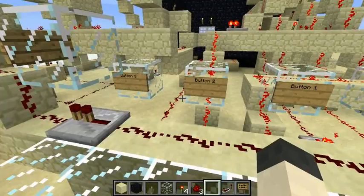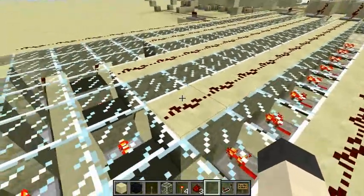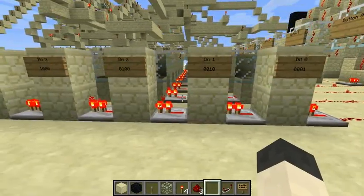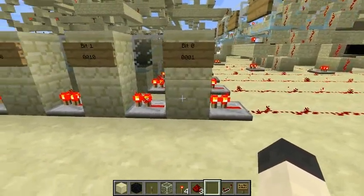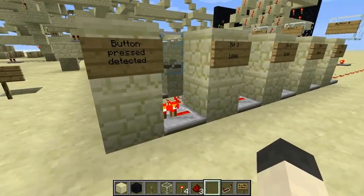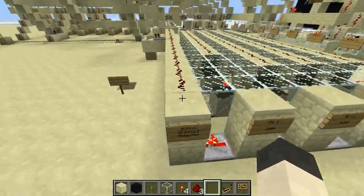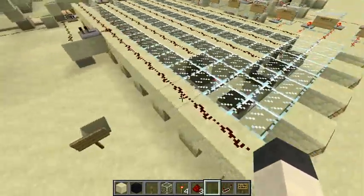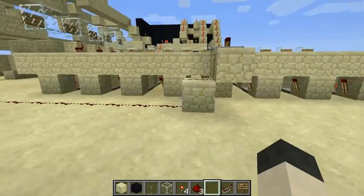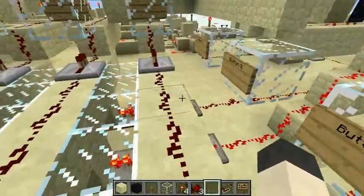So if you look, they're not in order or anything, so I have signs on them to tell which one's which. Down here, this section converts the button signal into basically a binary number — if you understand binary numbers, you'll understand this completely. This line right here detects that a button has been pressed; no matter what button you hit, this line always turns on. This acts as our clock signal for the circuit.